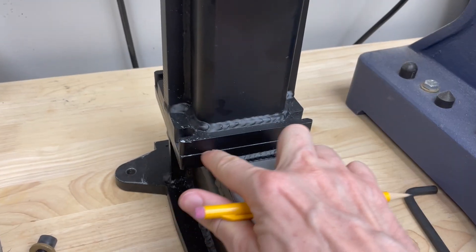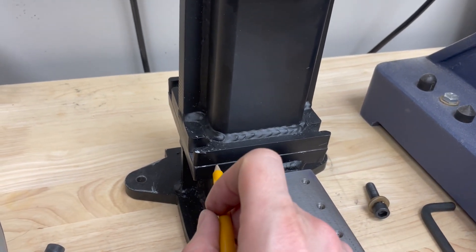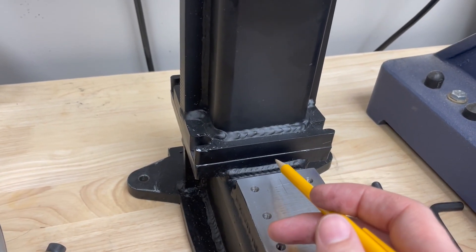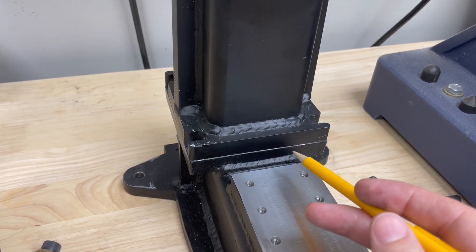This particular design is machined very accurately, and if you do need to tram it, the recommended method is to use a couple of shims — one or two thousandths thick. But I want to do it with epoxy. Even though it might not need it on this mill, it's more of a practice so I can use it on the one I'm going to design from scratch.